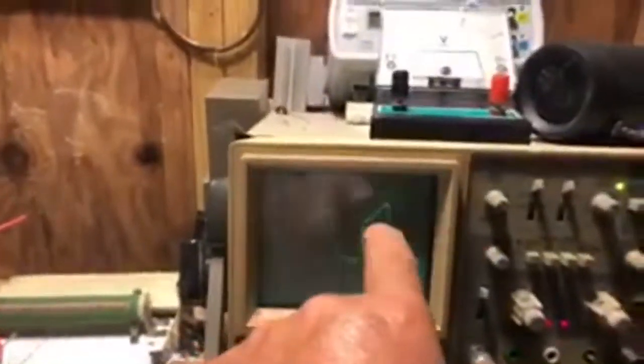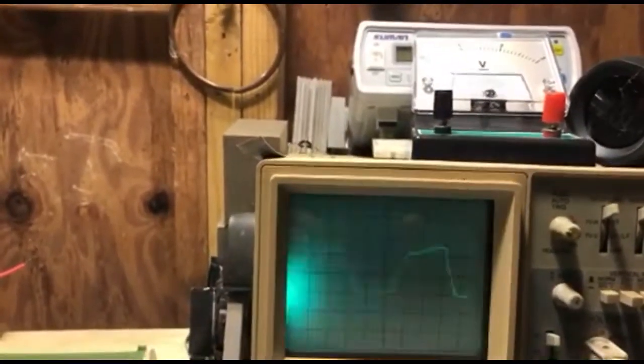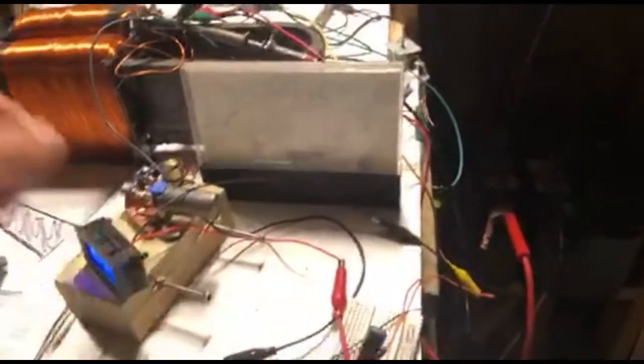Now, something I want you to see, I got it turning, just by hand. Look at the peaks. You can see there's a point up top. Now let's go ahead. You don't want that. You guys see that? At the peaks, looks like Gumby. Now that is an unbalanced AC wave. Unbalanced. The way to balance that is we're going to stick a capacitor.